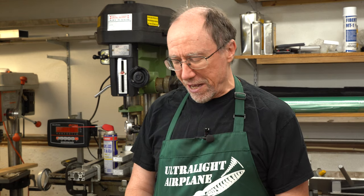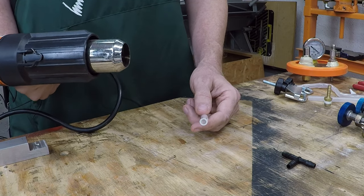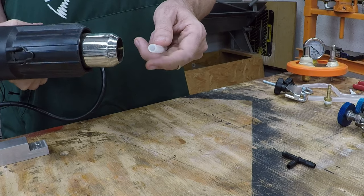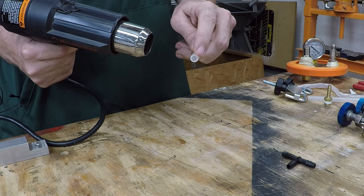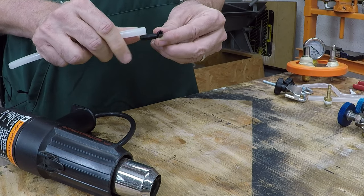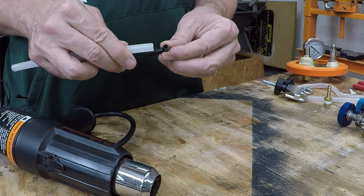This video is about preparing the tubing, so let's talk more about that. If you have experience pushing tubing onto T's, you know that's kind of a pain to do. There's something we can do to make that easier, and that is to use a heat gun. When you're applying heat to your tubing, you want to be very near the end but not all the way out to the very tip. If you only heat just the tip, you'll be able to push it over the first barb but the part behind that won't be soft enough and it won't go all the way in.